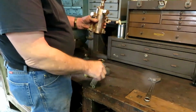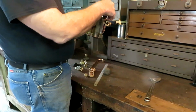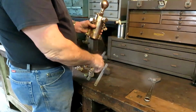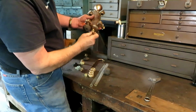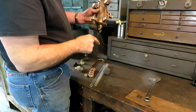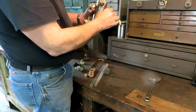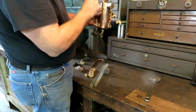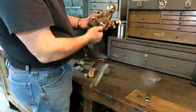This sight glass here, I have to cut these to length, shows you how much oil there is left. And when it's out of oil, there's a drain on the bottom here that you open up, and it drains the water out. And after you shut it off from the system, drain the water out, you can refill it with oil in the top and then turn it back on again and start it back up without ever stopping the engine.